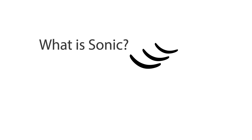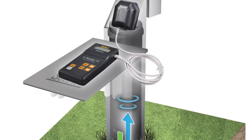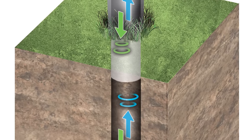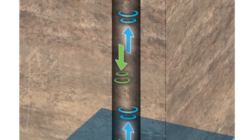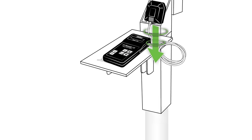So what is sonic technology and how does it work? Sonic uses sound waves to detect a water level in any closed tube. It's a non-intrusive method with nothing being lowered down the well. The sonic water level meter is set up at the surface with no open tube space around the probe.